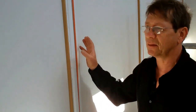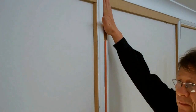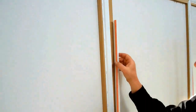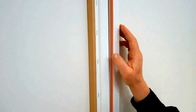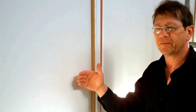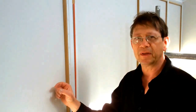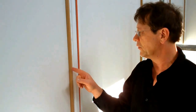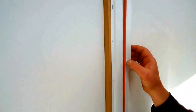We then, after dividing the wall in five parts, we install buttons. Normally we could install the profile directly on the wall, but because we use this system for acoustic purposes, we have to use a very high density acoustic absorber, about 25 mm thick. Therefore, we're going to use some buttons to compensate for the thickness.